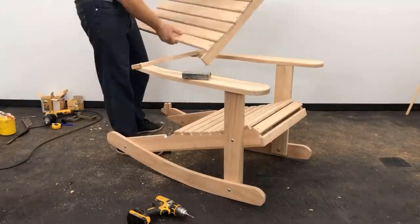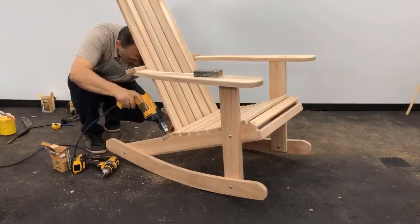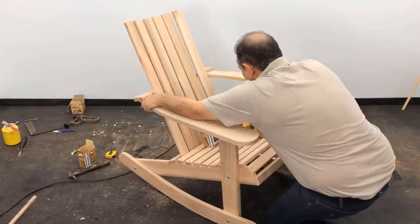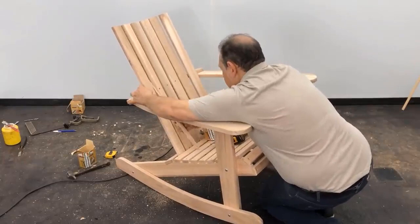The two rods on the outside of the backrest — I lowered them a little with sandpaper and matched them with a rasp because they rubbed slightly and didn't go in properly. We put two 52 millimeter long screws on the back, located the mark we had on the backrest support, placed the 1.2 centimeter division spacer, and finished screwing the backrest.